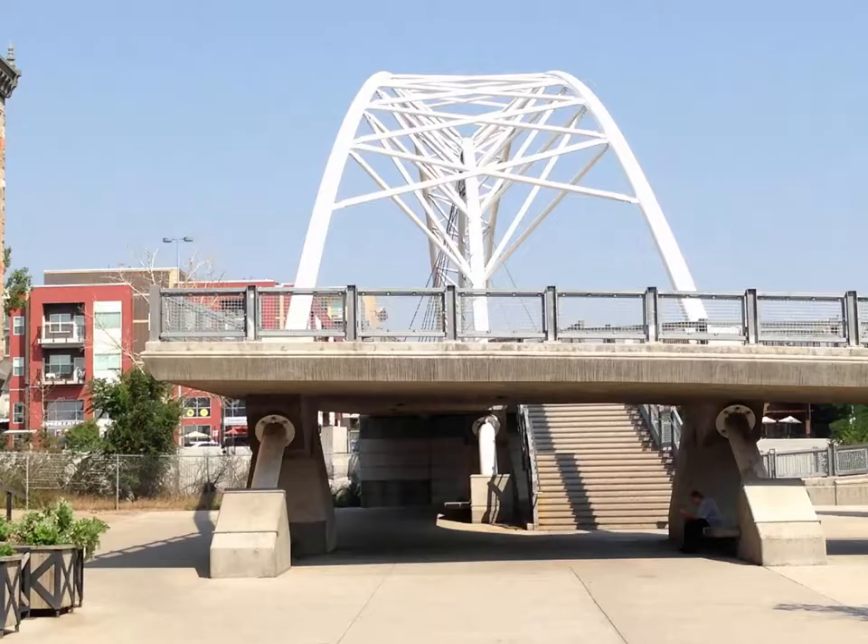The way we're going to achieve that is by using some sort of tubular element which works well in bending from left to right, bending in up and down deformation, and torsional deformation. In this case we're looking at a truss tube which brings loads down along this compression member to this buttressing element, along this compression member to this buttressing element, and then the center arch also carries its loads to this buttressing element.